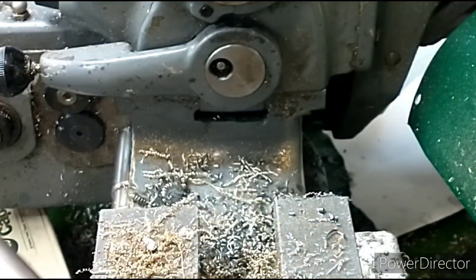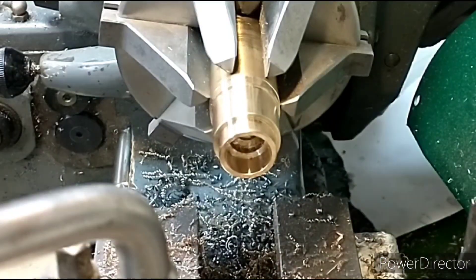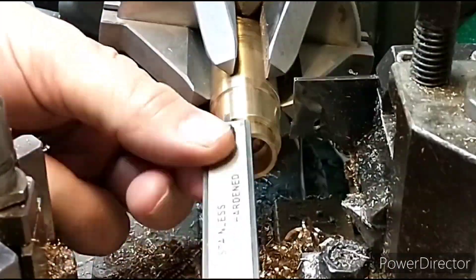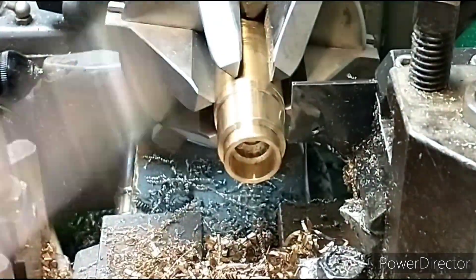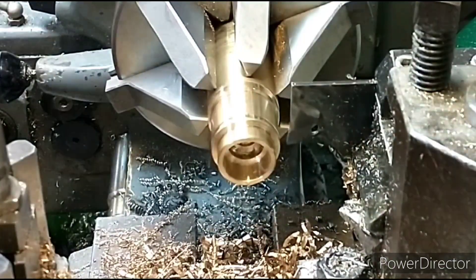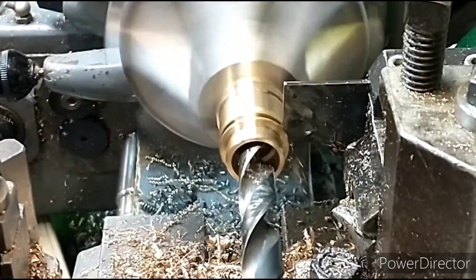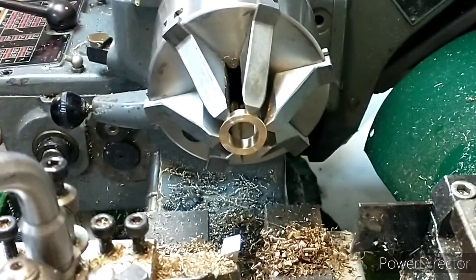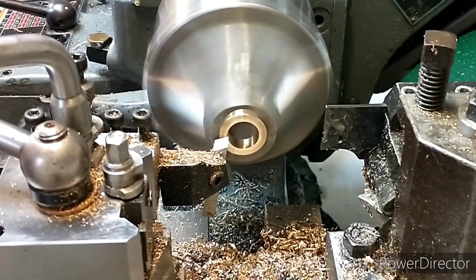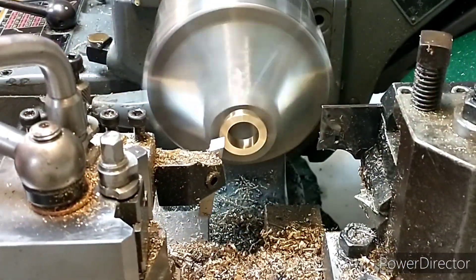I didn't actually have a plug gauge the right size for this bush, so I'm taking the whole thing off the lathe to try it out on the pin on the loco. After parting off, I've turned the bush round and I'm just cleaning up the parted-off edge, and also just chamfering the corners off as well, just so it's nice and smart.